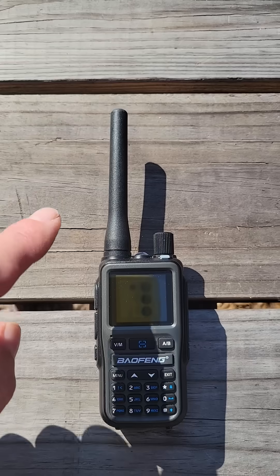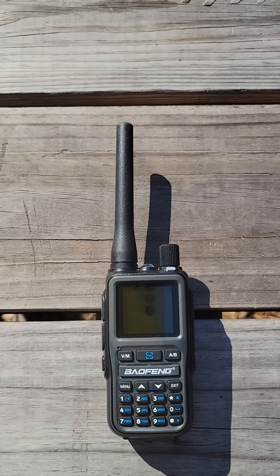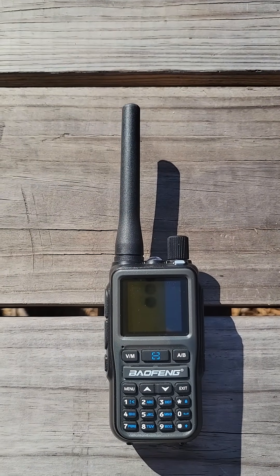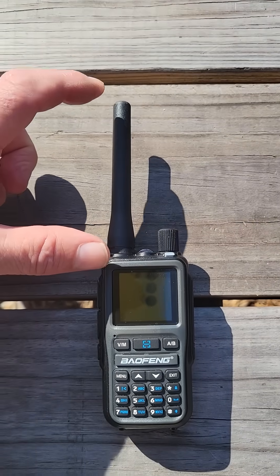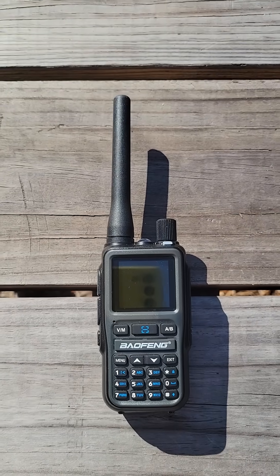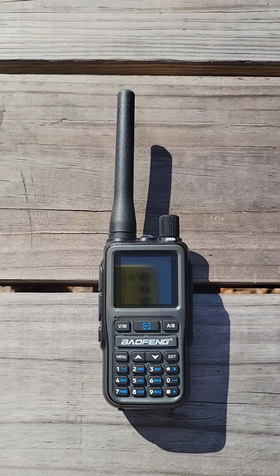Now, in doing so, I showed the sweep, and I said that there was some concern that I had because the antenna didn't behave like a shortened helical antenna, which is what you would normally expect from seeing something of this package size. And the antenna itself physically pairs well with the radio, but the performance of the antenna is rather poor.